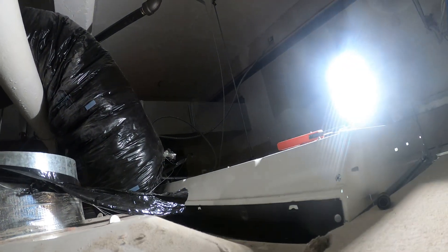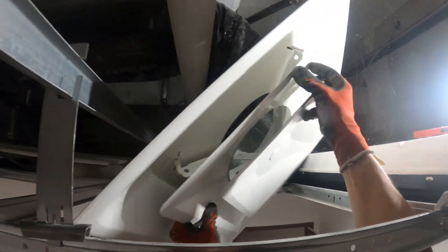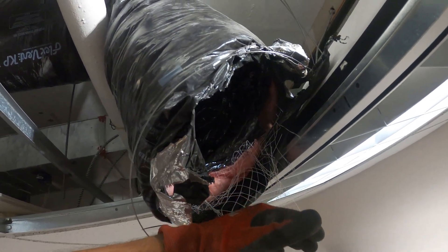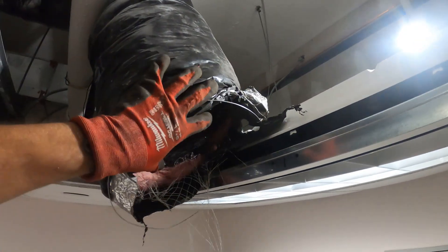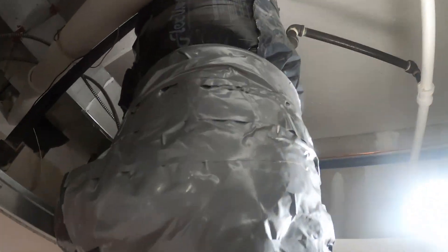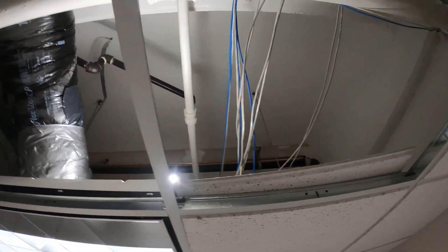It's a little tight in here. Considering this is insulated, this definitely was a second supply for this room since it is larger. I feel a little bit of air still passing through even though they closed the damper. Regardless, we're going to take a bag and just cover this up so hopefully we can balance out this room as far as airflow and then move on to the next room. Duct is now covered — no air is escaping and we can leave that in the ceiling.